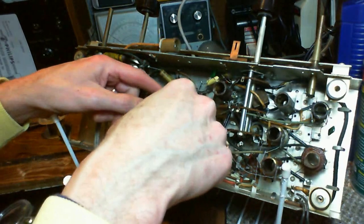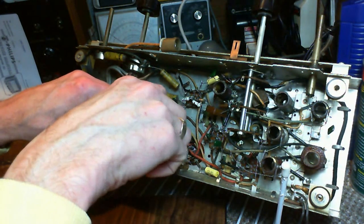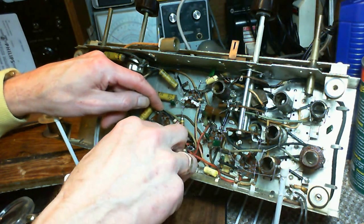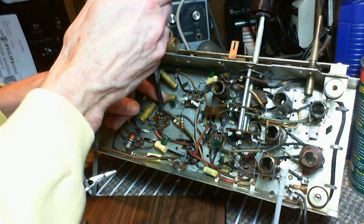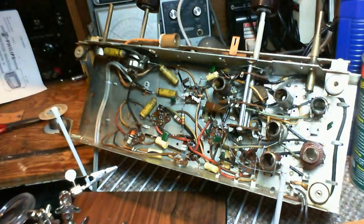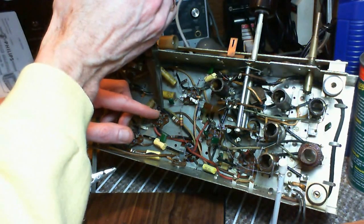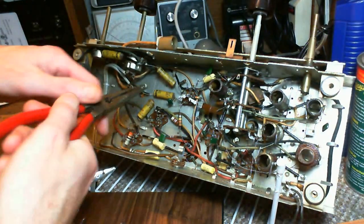You look on the scope and see which one gives you the biggest noise signal or hum — capacitive reactance between your fingers and the foil. It's quite distinct, but it's never marked. It could even be the case that this kind of capacitor I'm installing may actually be less desirable than the foil kind. I'll admit I'm no expert in this area. I think it's a fairly obscure piece of knowledge. Maybe if I read more about it I might find a qualified opinion, since it sure seems to be ignored today.